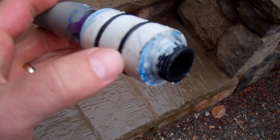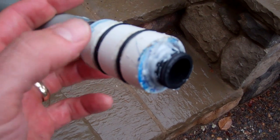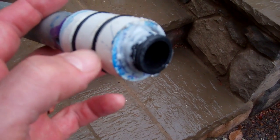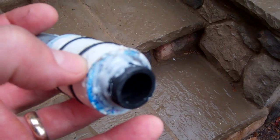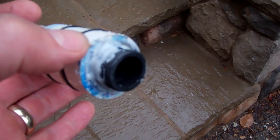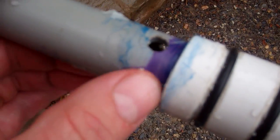These O-rings I had from Harbor Freight. All I did was use a Dremel tool to notch this out so they fit in here, and put a little food-grade silicone on it so it's somewhat lubricated and food safe. On the end here is that sprinkler system riser — the black pipe you can cut with a razor knife — and again I smoothed the inside so the marble will seat in here, making it truly a one-way check valve. The white stuff is epoxy, and we drilled holes here so water can come in. We also epoxied a stainless steel screw which stops the marble from going up.